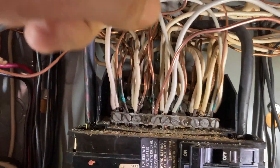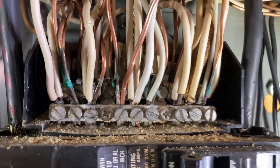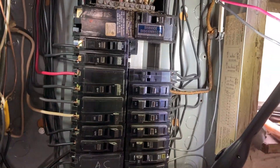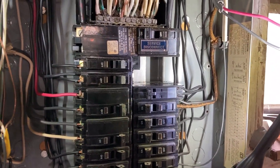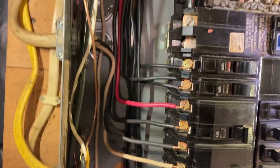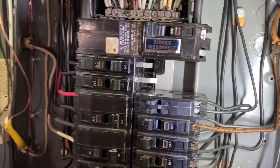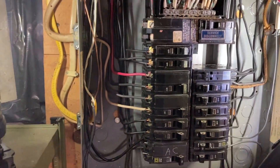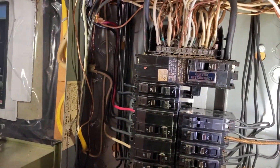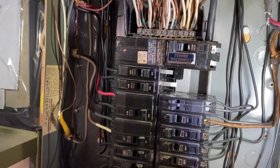I also got my ground wire and neutral hooked up — I just had to tap them in with some others. There's just not a lot of room for neutrals up there. They didn't give you as much room in these old boxes for grounds and neutrals as in the new ones, but that's okay — it's there. I don't have to replace this whole electric service, tear this all out and re-hook it all up. It might seem like a simple straightforward process, but it takes hours — it's a lot of work.